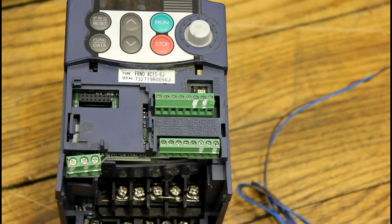You as a user would then set the parameters to control the drive from that 0 to 10 volt input — though I can't be specific since each drive has its own programming. Two other terminals to be concerned with are CM and FWD — common and forward. That allows us to use a thermostat with a contactor: when the thermostat makes a call for cooling or heating, it will short those two terminals together and tell the VFD to start, and then the drive will be controlled by whatever the temperature controller is commanding.